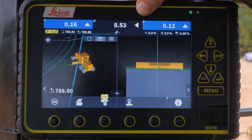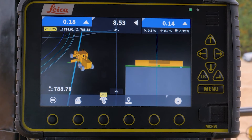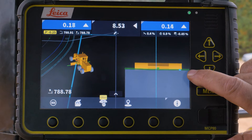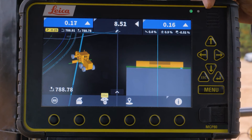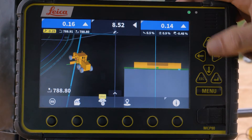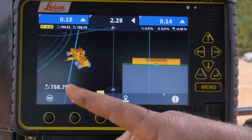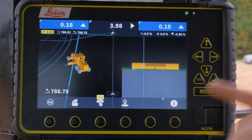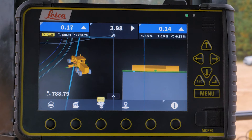Now it says I have to go 8.52 feet to get on that line. You might ask: what part of the blade am I trying to get on that line? At this point it is this blue tick mark, which is the reference point of our blade. Right now I'm eight feet from that line. I'm going to slide that tick mark to the middle — acting like it's the middle I want to follow. So I slide that to the middle and now I'm only two feet from that line. If I wanted to get the left tip of my blade on that line, I would move the blue mark to the left tip of the blade. Now I've got to go four feet that way to get the left tip of my blade on that line.